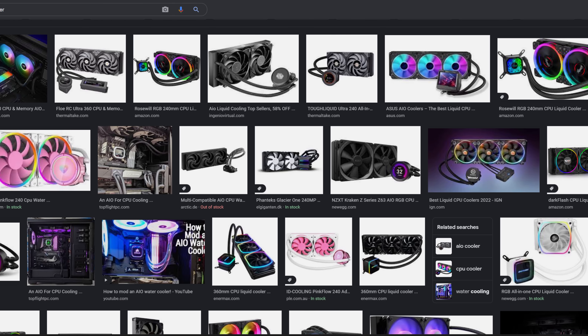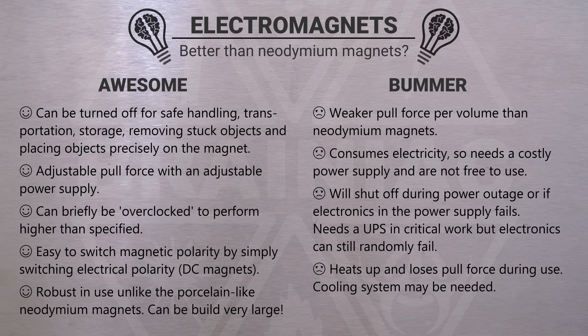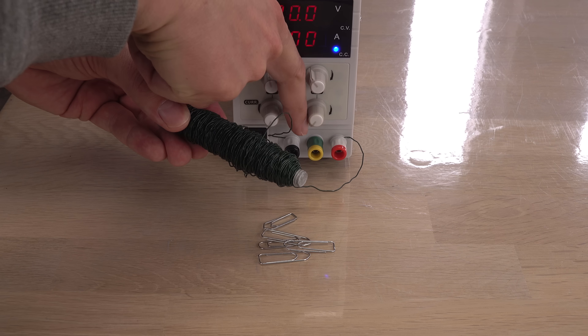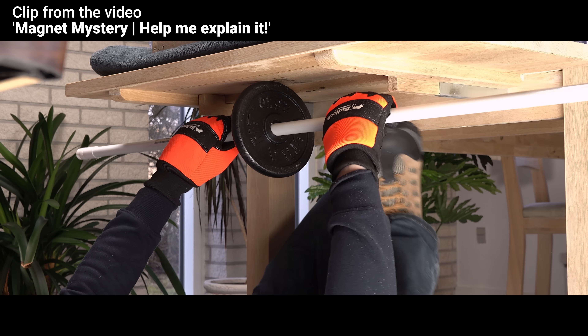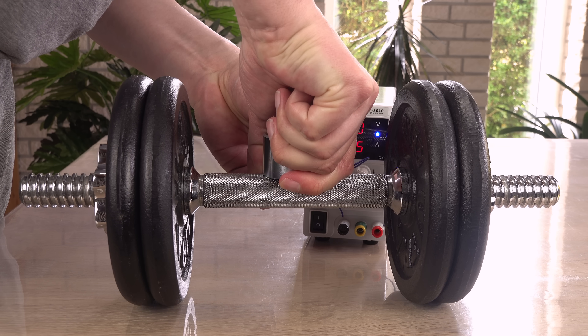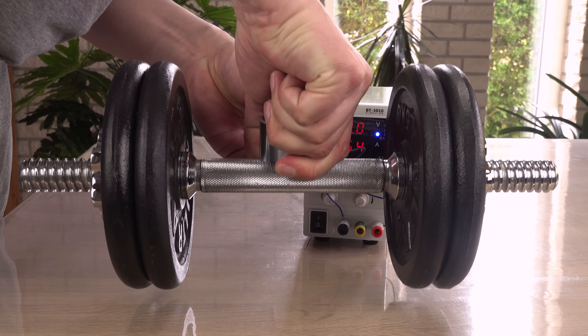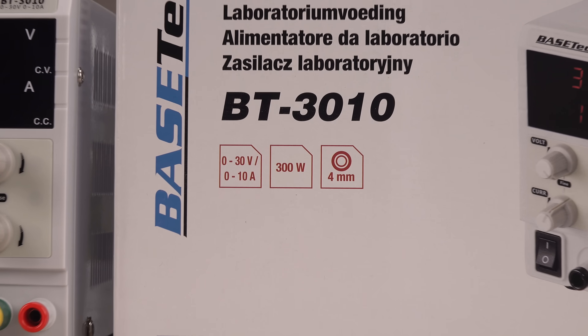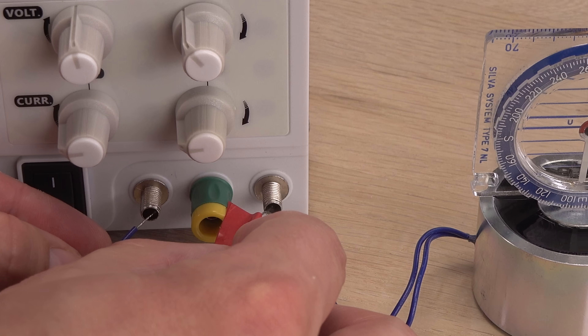How do I sum up my first experiences with a commercial electromagnet? The pull force per volume is not impressive compared to neodymium magnets. I don't like that it heats up, lowers its pull force when in use, and you have to trust a power supply. However, I absolutely love the ability to turn it off and easily vary the pull force and polarity — that is so much more convenient, safe and flexible than a permanent neomagnet. I will definitely experiment more with electromagnets. Click like if you want to see more videos on it and comment if you have a test you would like to see. I think I will try to go bigger in the future — my lab power supply will deliver up to 300 watts. Thanks for watching. Bye for now.